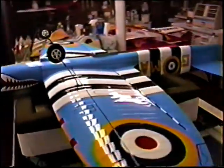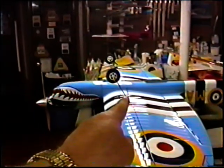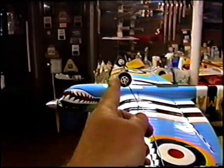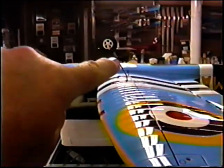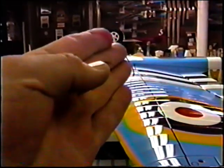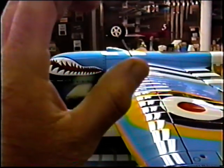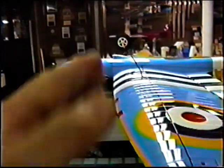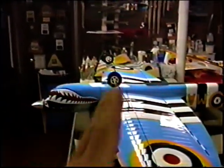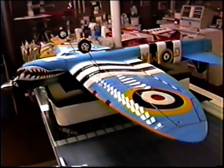Anyway, I'm looking at the position. Now the way I bend these is I take this one off first and bend this one forward maybe 1/4 inch. Then I can sight down the wires. Notice I'm looking right at the wires and see that they're parallel. As soon as I get this one as far forward as I anticipate it may have to go, then I take the other one and bend it so that they're both equal. Rather than trying to bend them both at the same time, it's always better to bend one at a time. I've found that to be a much better choice.